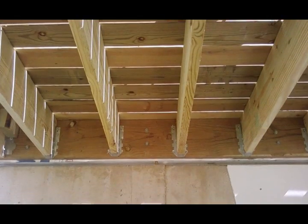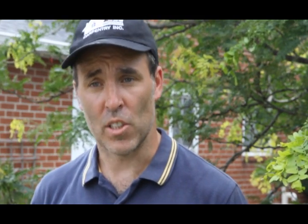The second method of building a deck is attaching it directly to the house using a ledger board. This is a very good way of doing it. There's also a third method, which is an independent deck. It still has a footing, it's still dug into the ground, it's still solid, but it's not actually attached to the house.